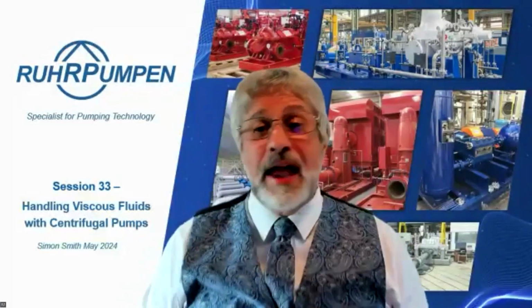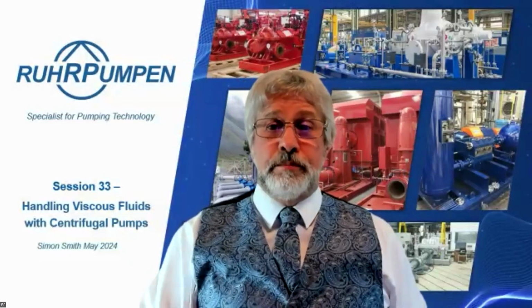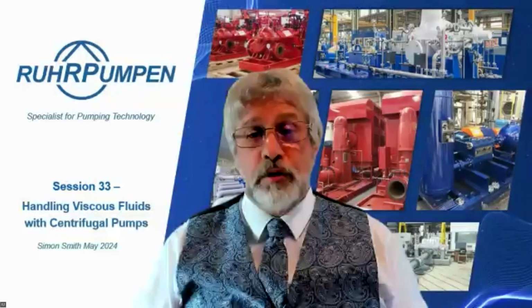Fundamentally, we don't change the NPSH curve. We don't change it. It's possible, if you've got large quantities of gas entrained in the fluids, that it will be a higher NPSH, but generally, when you've got only small amounts of gas or developed fluid within the pump fluid, it doesn't impact on NPSH. So just give yourself a bigger margin than you might have done if it was a thinner fluid.